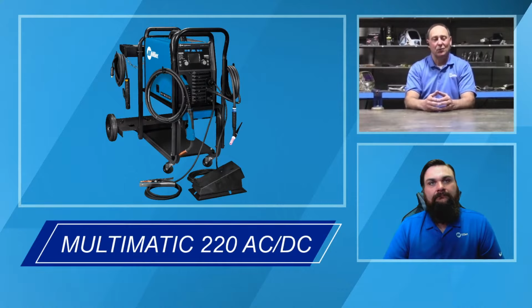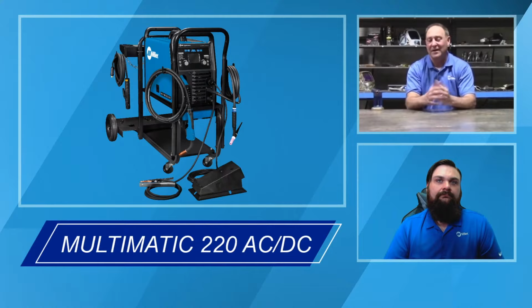And that's the same true for people who are out in the MRO markets. If they want to go out and weld thicker gauge material at more sites, typically in the past, a transformer-based machine with SCRs, when it was hooked up to the generator, there were some issues with the output of the machine. You would have to derate that machine hooking it up to a generator. That's not the case with an inverter power supply.